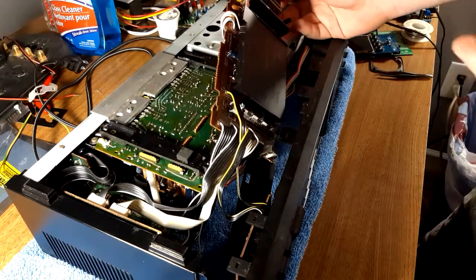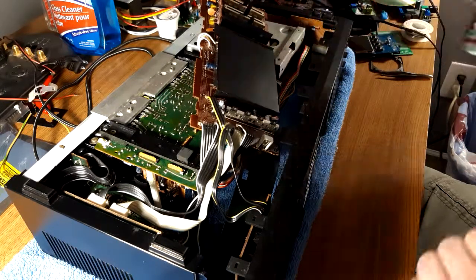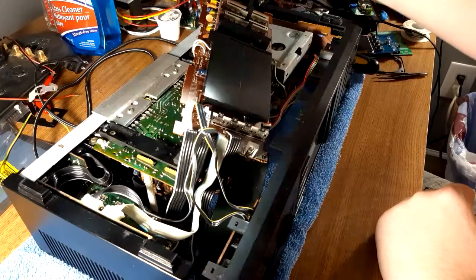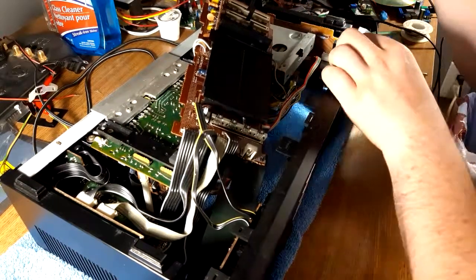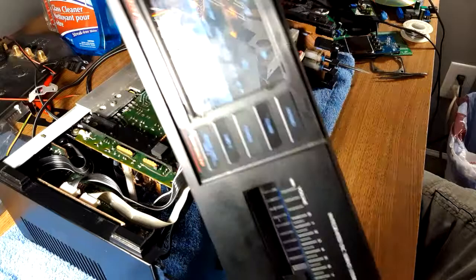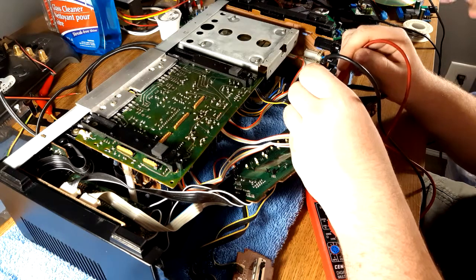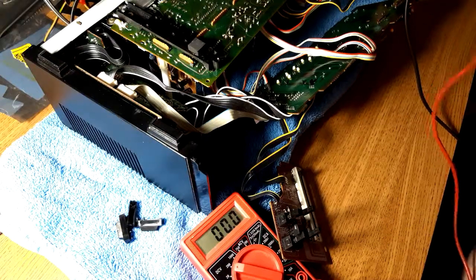There's no connectors — all these wires are soldered in. Make sure you don't get dust on that matte finish because it will fingerprint. None of these cables are held in with connectors; they're all soldered in. This is going to be a major pain. I can see it — I just have to stick my screwdriver in there and pry it out. It only took one of these high-powered flashlights to be able to see it. Now, with the face off, I'll plug it back in and measure voltage at the bulb. God the light's dim — we have 0.8 volts, or maybe 0.08 volts.